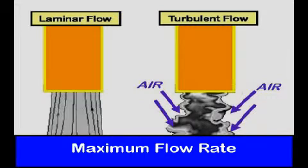The high gas surge at the weld start pulls air into the gas stream, creating excess spatter and possibly internal porosity. Before we discuss how the patented ESAB Precision Master Gas Saver can save money and improve weld starts, we'll review some basics of shielding gas flow.